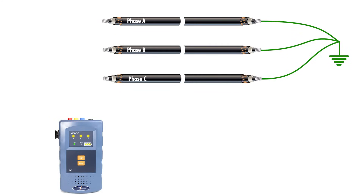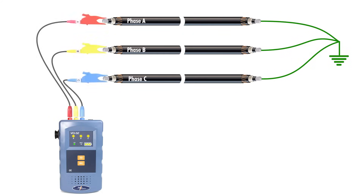For the direct injection method, install the leads on the top of the transmitter and connect the clips to the cable conductors. Make sure to match clip A, B and C with the corresponding cable phasing, as it will later be necessary for phase identification applications. Incorrect transmitter phase setup will yield incorrect phase identification.